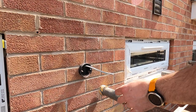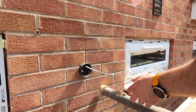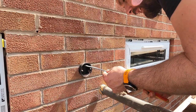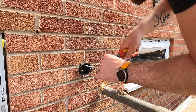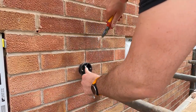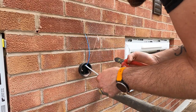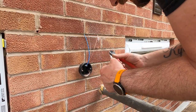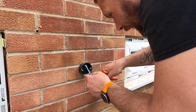It's just using a red rawl plug and some 30mm screws — more than enough for this. If you're going to whack it, it's going to come off anyway no matter what you do. You can use WAGOs if you want in here and that's perfectly fine. Some of the light fittings' terminals that they come with are pretty naff, to be honest. This one — they're not too bad. I think they're Knightsbridge lights. They'll be okay. I mean, they're not perfect, but it's all down to money for everyone.